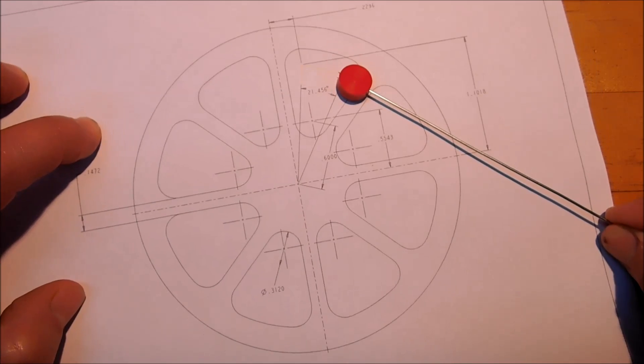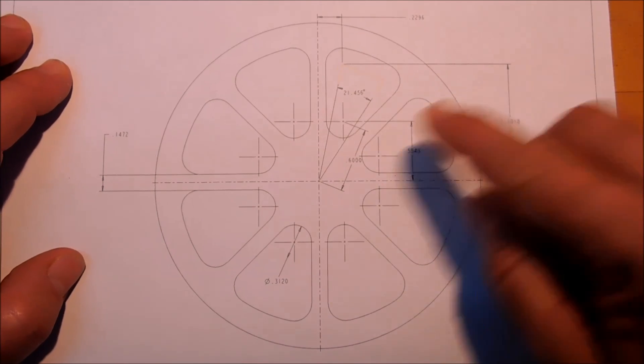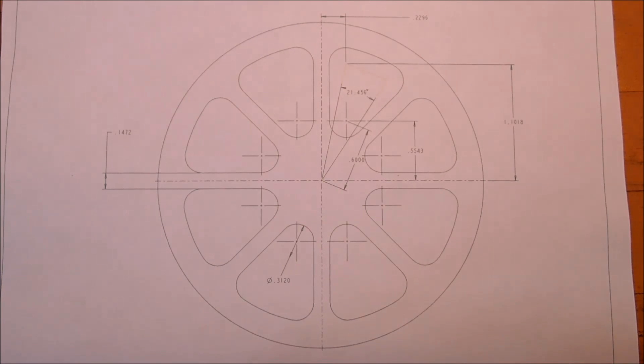When I'm done I'll just come back and pick up one location and do all of the windows. I'll move the tool into position with a combined Y-X move, and then all of my moves will be 45 degrees apart. Let's put the part on the table — I'm not going to bore you with the setup, because you know the center of the part has to be over the center of the table. Toe clamp it down and let's get this done.